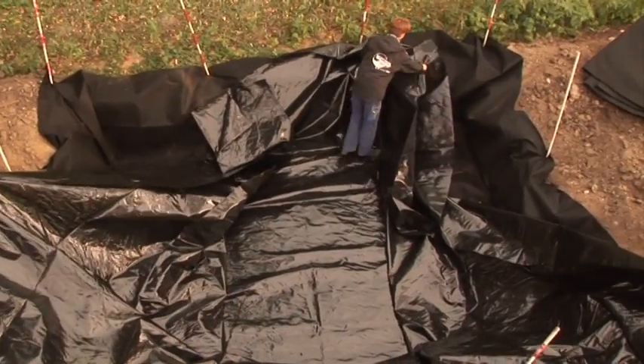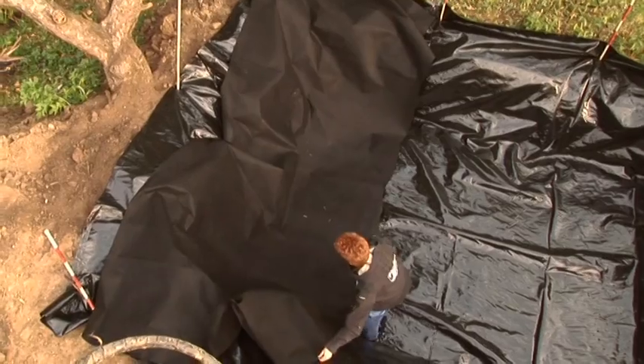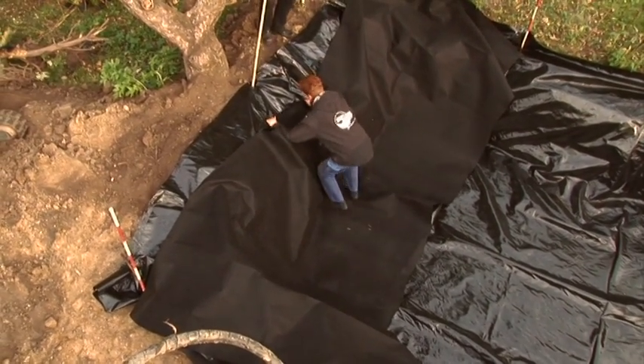At the bottom of the pit is a waterproof membrane, well protected by geotextile both inside and outside. This membrane keeps the wastewater inside the Reed Bed until it is cleaned and discharged through an outlet in the bottom.